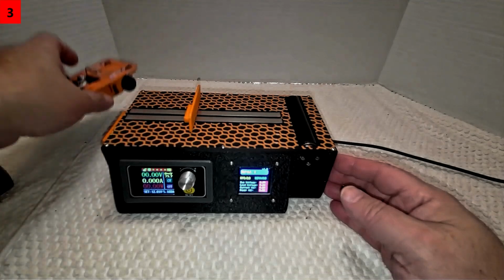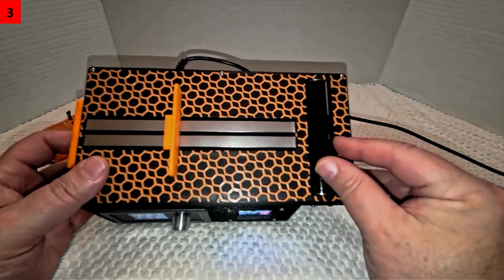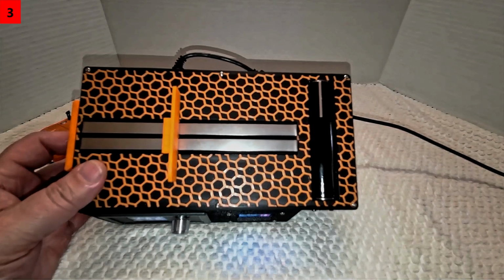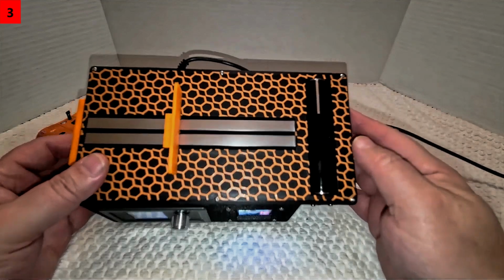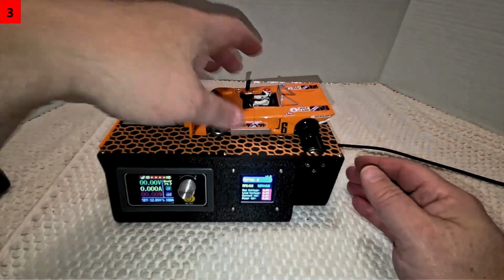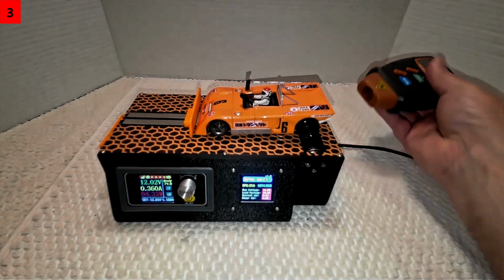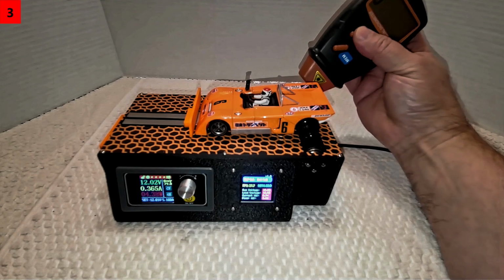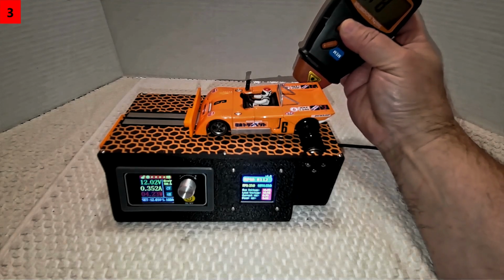In addition to its benefits as a diagnostics tool, the balanced roller also means you're able to get reliable readings as well from an RPM perspective. On the roller, you'll see a reflective strip. This is used by the tech bench to measure the roller's rotation and your car's RPM. This strip can also be used by an external laser tachometer if you wish to review or double-check the tech bench's readings.